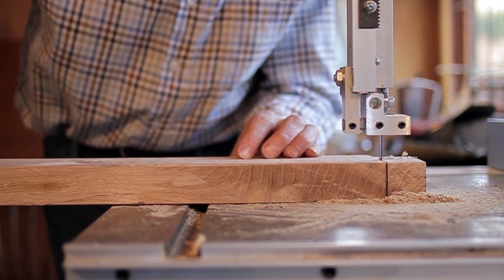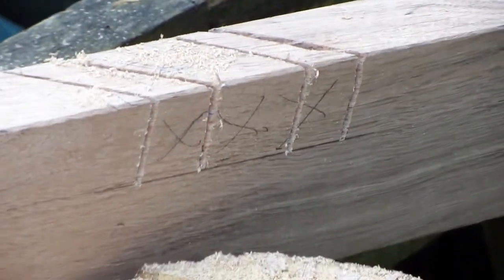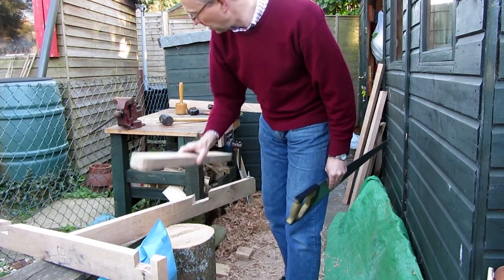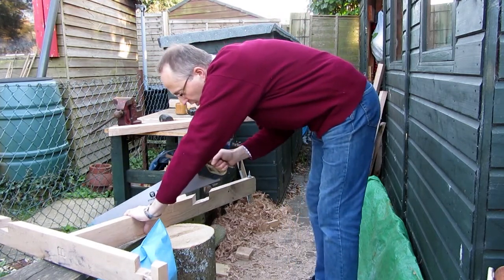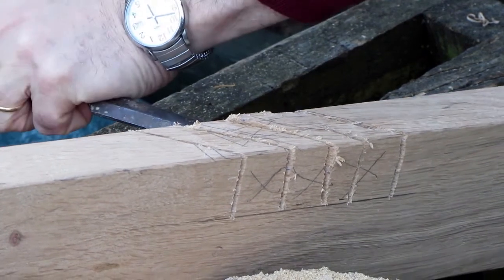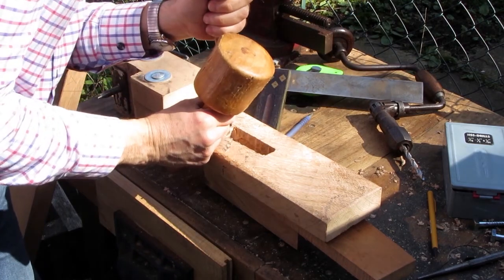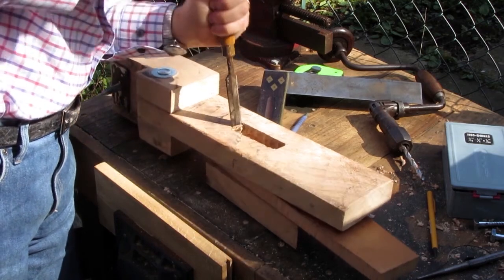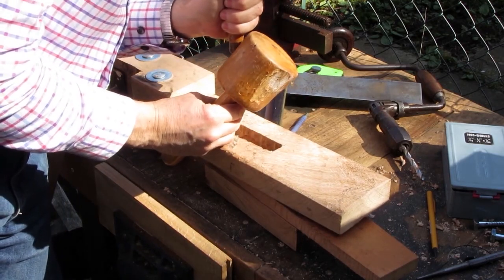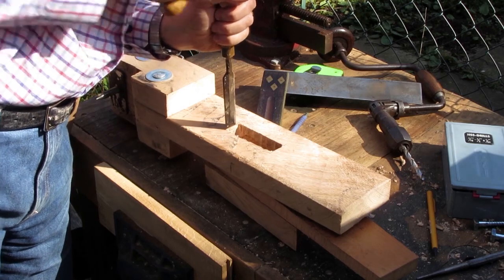And the final cuts — that's a quick tenon joint cut. I'm cutting the joints now for the uprights, putting in cross battens going across for double bracing to get a nice firm upright post. I'm just cutting them and then chiselling them out. Using a chisel to remove the waste, and in this shot I'm removing the wood for the tenon for the headstock of the lathe, using a mallet and bevel-edge chisel. Green oak is wet and very workable, so I can do this quite quickly and easily. It's quite a satisfying wood to work with, as everything works so much more easily.